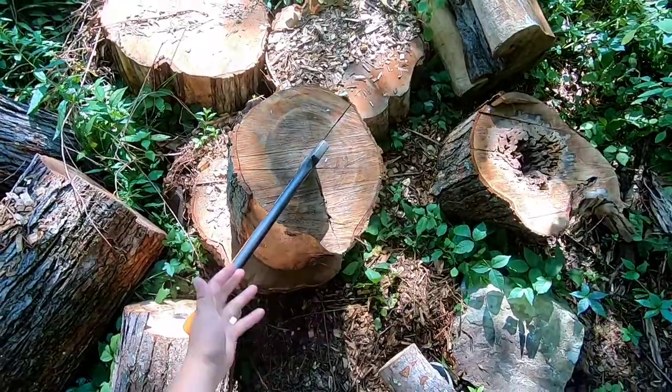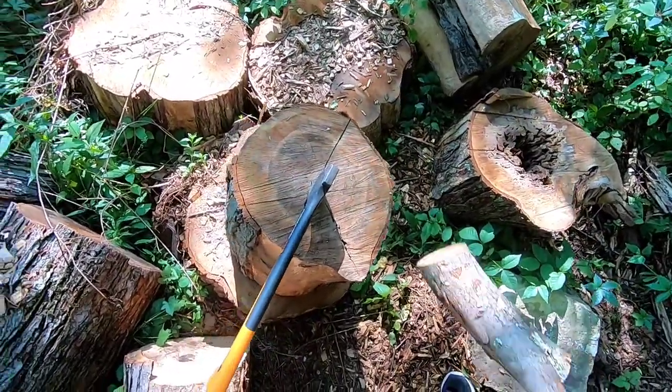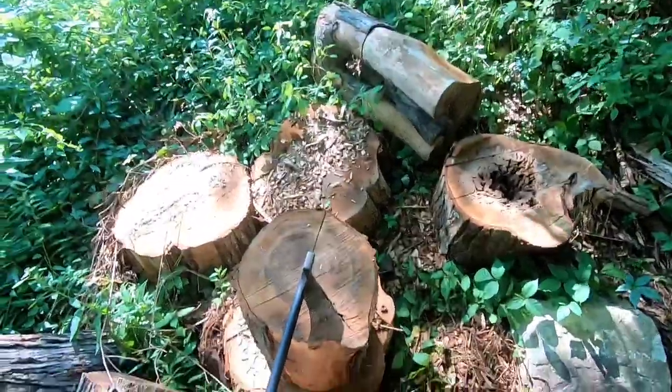this handle is a decent amount of leverage but unfortunately these aren't indestructible, and if you're really wrenching at this trying to remove the axe head, there's a chance you might not break it today, but the wear and tear will start to compound and you might break it tomorrow, and that's never good. Also, there's one big safety reason I forgot to mention as to why you don't want to pull up on the handle to try and remove the axe head. It is going to take a lot of force to pull that axe head out of the wood, and once the axe head is free, all that force is going to turn into kinetic energy and you will not be able to control where that axe head goes once it does. In general, you never ever want to apply uncontrolled force to a bladed tool to try and make it do something. It's a recipe for disaster.